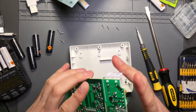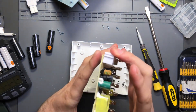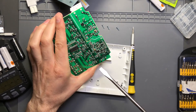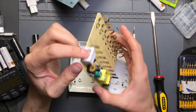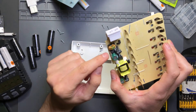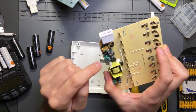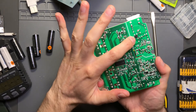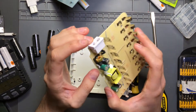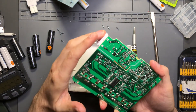Let's make sure the big capacitors are discharged. Line voltage comes in right here, through a fuse that's heat-shrunk, then a common mode choke for noise suppression, then another wire-wound inductor, and then a full bridge rectifier. So common mode choke to the full bridge rectifier, back to an inductor - that's probably used for the switching circuitry. Then some bulk capacitance to smooth out the DC rectified voltage.